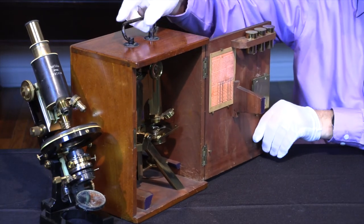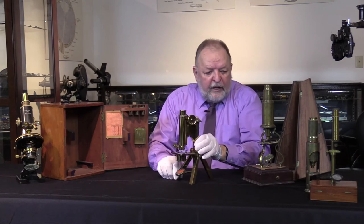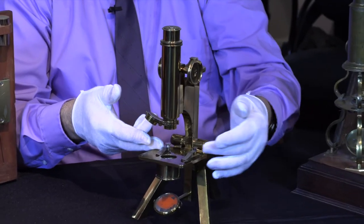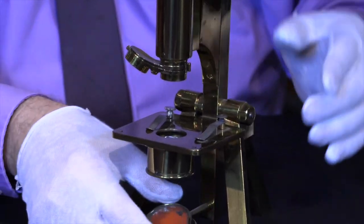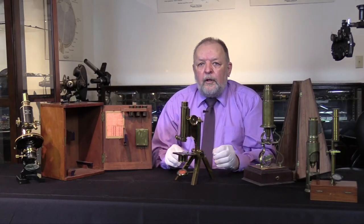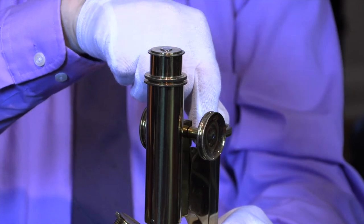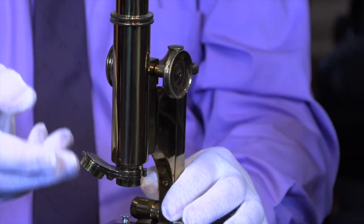A lot of craftsmanship went into microscopes. This one is from maybe mid-1800s and is actually heavier than any of the previous ones. Again, we have an adjustable focus here and clips on the stage for holding specimens or slides. Beneath the stage, we have what's called a condenser, which takes the light reflected from the mirror and essentially strengthens it — condenses it — making it focus on a much finer point. This one actually has two focuses: a coarse focus and a fine focus knob. There's a difference of maybe 10 to 1 in the gearing, so it would take 10 turns of the fine to equal one turn of the coarse, allowing much finer focusing.